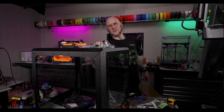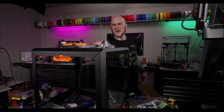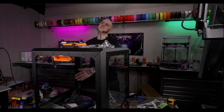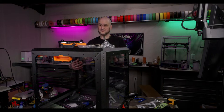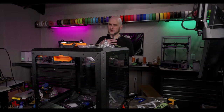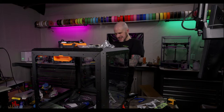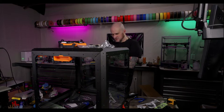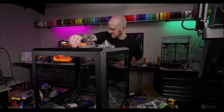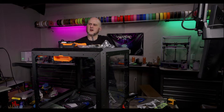I have a carbon and HEPA filter on my 2.4, but ABS smell still manages to escape. My panels are not that well closed. What are you running for filter? One that externally vents, or an internal one, like a Nevermore? ASA smells less in general, in my experience, so that might improve things for you, but you should try to tighten that up a little better. It's going to be better for printing anyway. Reduce external on an exhaust box.